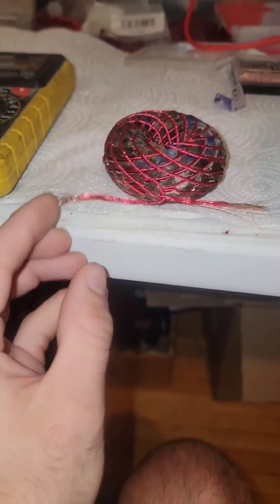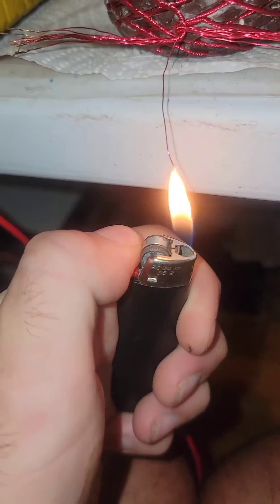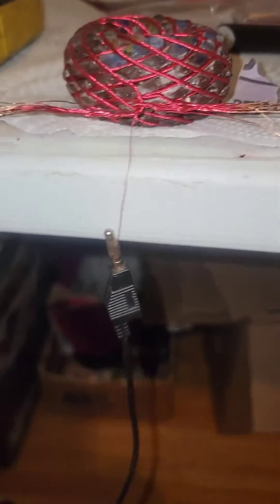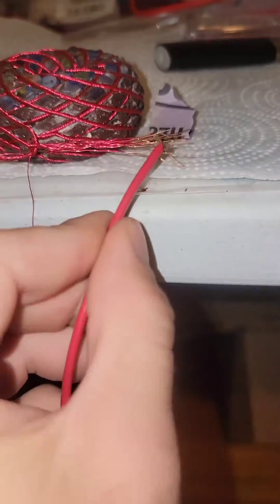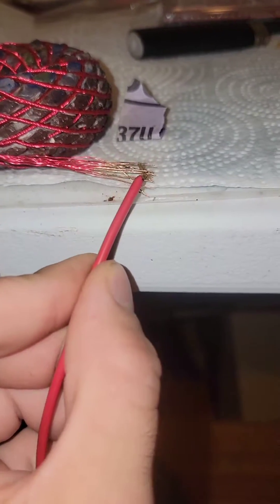From my left side, I'm going to pick one random wire, bring it to the middle, go ahead and burn the enamel off that wire, and sand it up. Once I've sanded that one random wire from the left side, it's just going to hang down here attached to my ground lead of my multimeter. Make sure it beeps. Now from this side, we're going to try to find our beep on one wire. As you can see — already beeping, found it.